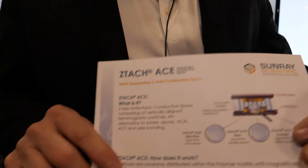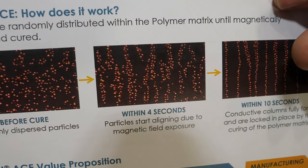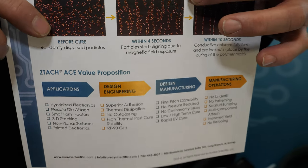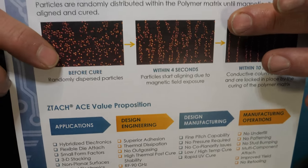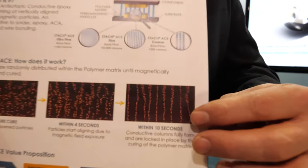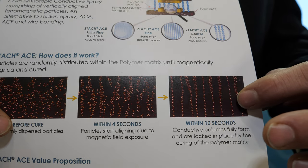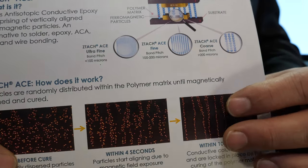Before the cure, it is randomly dispersed ferromagnetic particles in the matrix. This is what the material looks like before the magnetic field is in place. Once you stencil or dispense our material and place the components, it has all these randomly dispersed particles in the matrix. As soon as we put it onto our magnetic pallet before it goes through the reflow or batch process, once it's engaged into the magnetic system, the material gets excited. During that excitement, it creates electrical interconnections in the Z-axis. Everywhere in the matrix underneath the components are these highly densely populated ferromagnetic Z-axis columns. You're not getting any XY conductivity between different pads or connections because of the fine column spacing we have in our present columns.